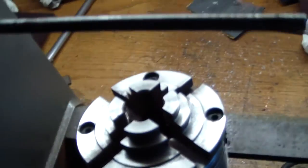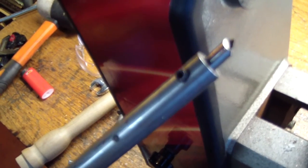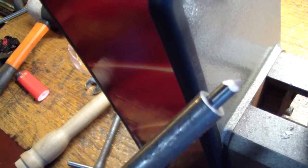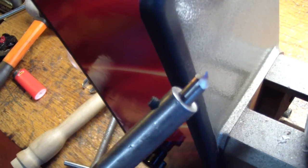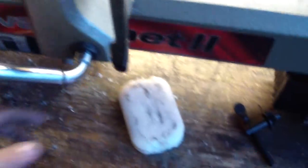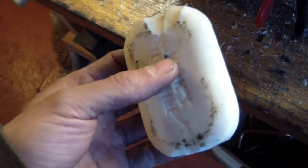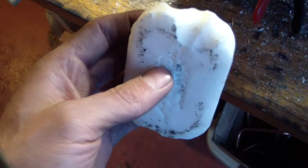I'm going to be doing some more work with those tanks and maybe I'll be able to make my own filter dryers for the refrigeration setup. In addition — although I haven't finished this yet — I just took a piece of high-speed steel, drilled a hole in the end, put a tap in a hole in the side for a set screw, and shaped it roughly on the grinder. I have no idea what I'm doing, but it's sharp enough that it'll easily cut copper so I can trim the ragged ends of the copper tubing.